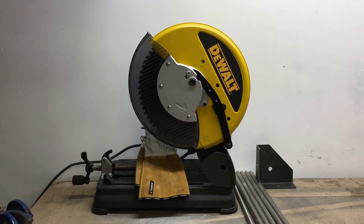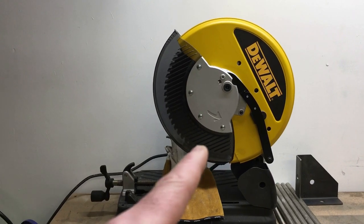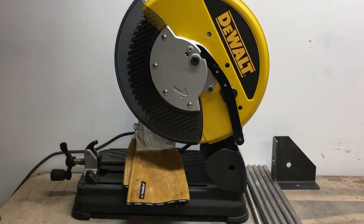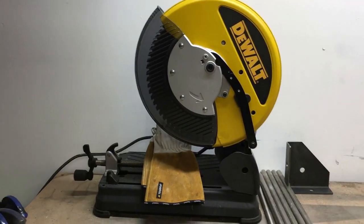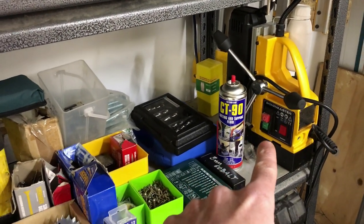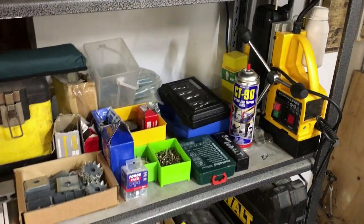This is my chop saw — for cutting steel this is my preferred tool of choice. It has a TCT blade, so it's a cold cut chop saw. When you cut steel with this it creates zero sparks and minimal heat — you can cut steel and the metal doesn't get hot, which is ideal in an enclosed space like this with all this equipment around. Another bit of equipment is the mag drill — a Bore Master mag drill used for boring large diameter holes in steel.